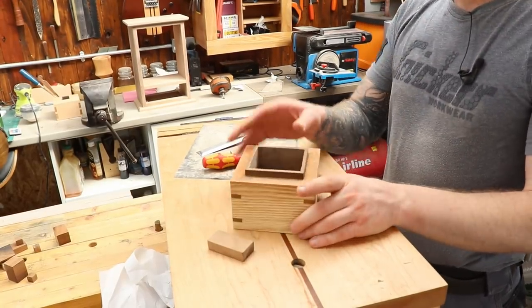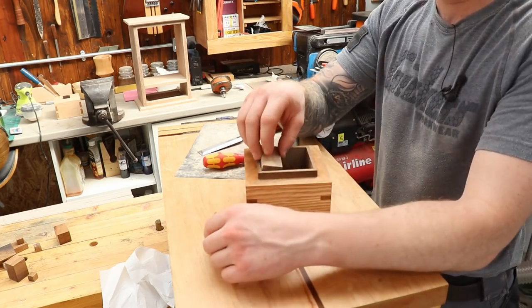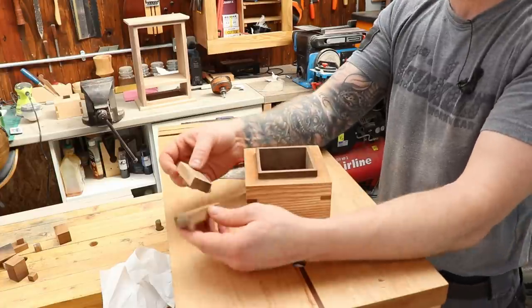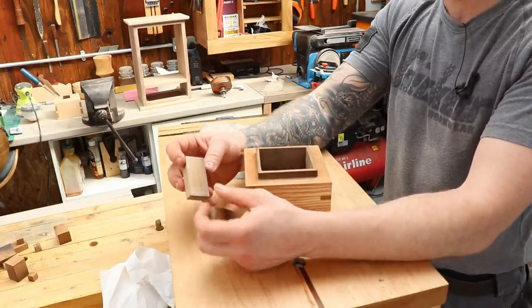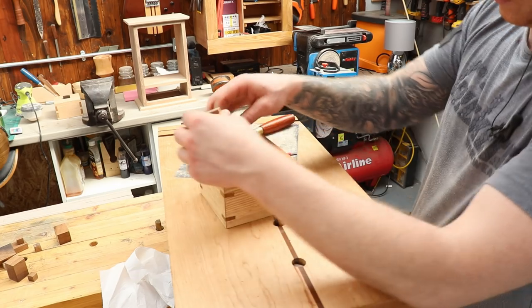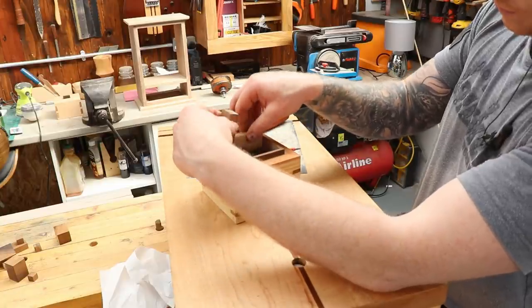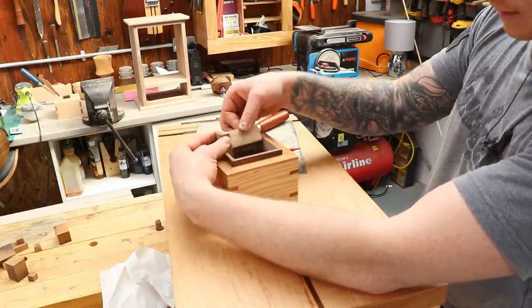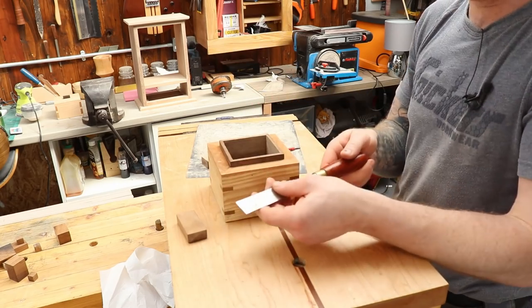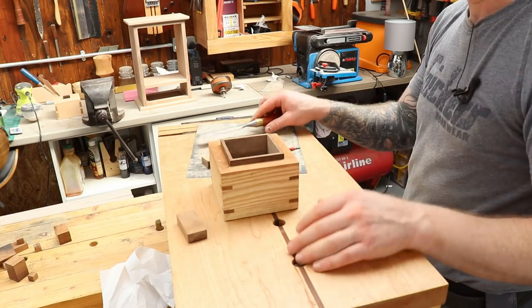Quick tip: make sure you keep your internal box about two millimeters oversized. I made mine exact — put in all my pieces, they fit absolutely perfectly, but they were nearly impossible to get back out again. That's no good for a puzzle. It needs to be slightly loose. Use your two-by-four pieces to check that you're nice and loose the whole way across — it should feel loose, not snug. If it's snug you'll never get the pieces back out. I had to pare down the inside wall with my chisel to give myself that extra couple of millimeters all around. Make sure you have a super flat-backed chisel for that. Re-sand the inside, refinish it, and we're just there.